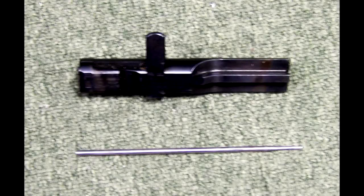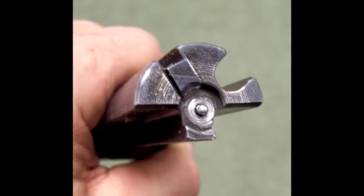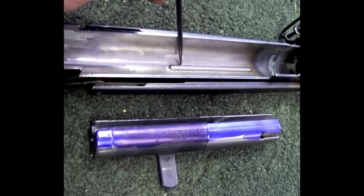Here you see where we started making the firing pin out of 3/16ths drill rod. Here we've got a little spring that I just pulled out of the drawer, and this is what we're going to use for our firing pin return spring. Here you see the firing pin's been fitted up, and we have pretty good looking firing pin protrusion. The next part we're going to do — you see in the top of the receiver we have what they call a denial rail. This is to prevent you from being able to put a fully automatic bolt back into the gun in the future.